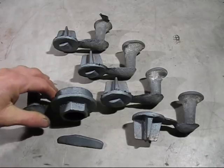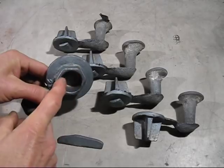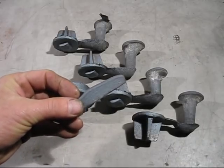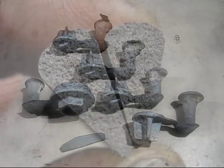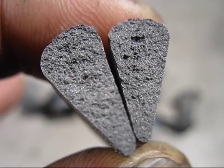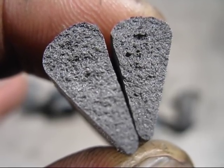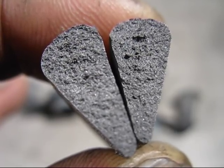This part here is a green sand core and it didn't break off — it came out really nice. And there's the wedge test — I'll quickly break it and we'll see how it turns out. Here are the wedge tests: they're grey all the way through, even though it was a smaller wedge test. But I need a really soft iron for this because I've got to machine all these castings, especially in the lighter sections which are prone to chill.